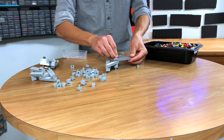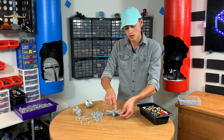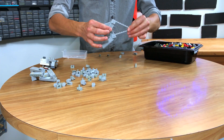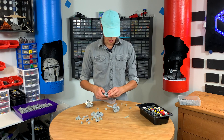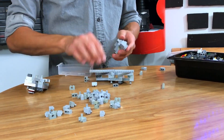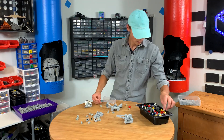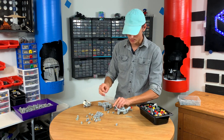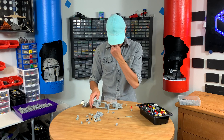So if we put this here and we kind of link these together with our fingers, this is the pivot point it's going to be on. So you can see if we spin this area in a circle here, we get this kind of walking motion. I can lift it up. So if we have this on the drive shaft, then it will basically walk like that. So we just need to do the same thing on this one because apparently I did it wrong the first time.